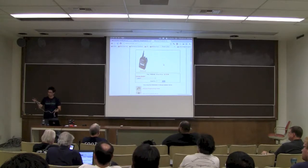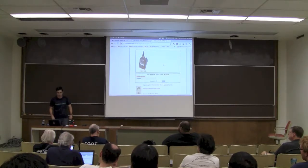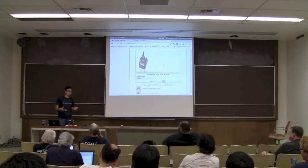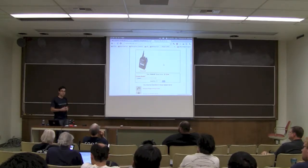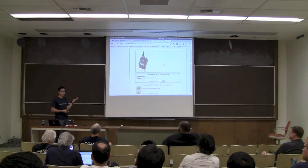So, I mean, for doing that, you probably want to use something like this. This is ungodly big, but all this is an isolation transformer. So you connect it to your sound card in your computer, and you use your computer as a sound modem. And the isolation transformer just makes sure you don't put RF into your computer through the sound card, and your sound card doesn't put hum on your radio. So you could do cheap things like that.